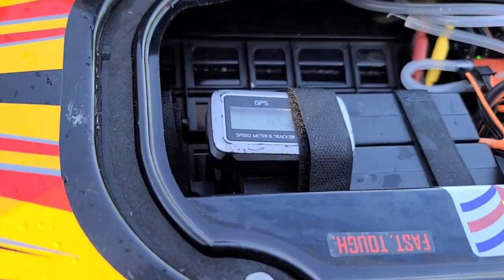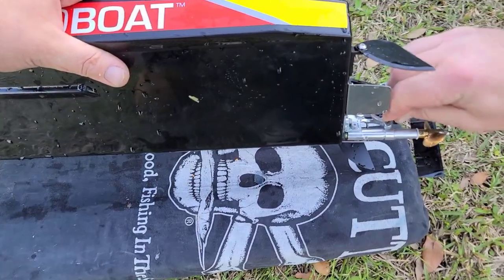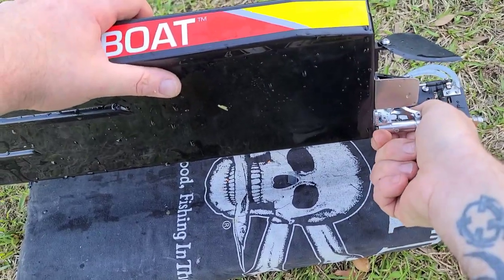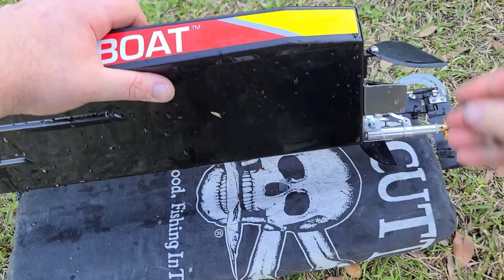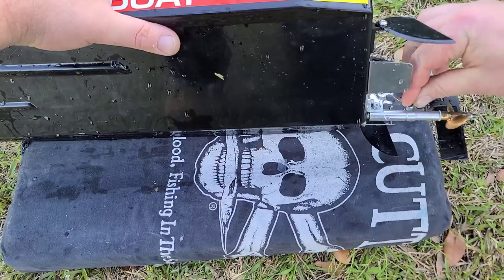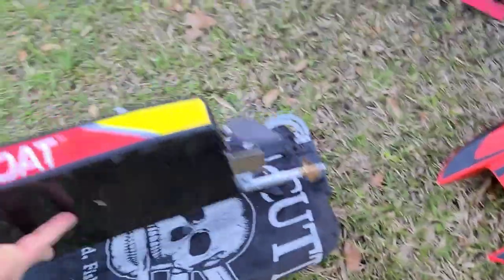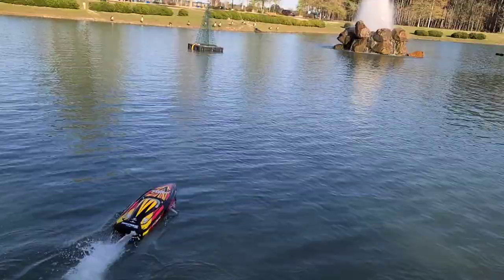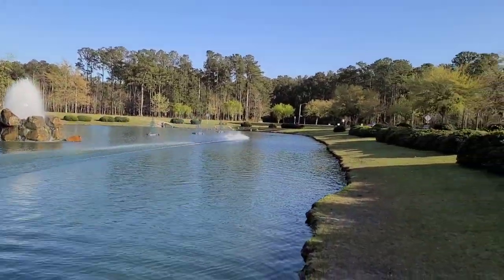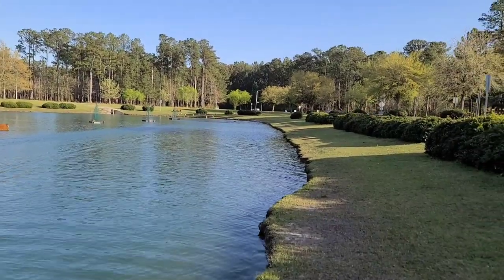Running inline with the boat I got 47 mph. I put an Octura 645 on this boat yesterday and it was a little too much — it's a big prop for this hull and it didn't like it. I put a little more down angle on the stinger and am checking that out. Handling wise, the only thing I could complain about is the left turn — that's it. Everything else is on the money.